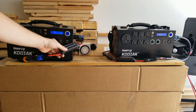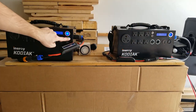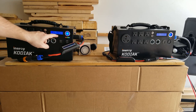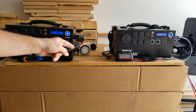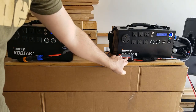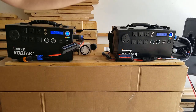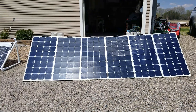You've probably noticed these little adapters connected to my Kodiaks. These are custom-made panel watt meters. The screens on the Kodiak itself only display how much energy is being output — they don't show how much is being produced. These custom watt meters let me see live exactly how much wattage and amperage I'm making from my solar panels. Right now I'm at 30 amps, about 400 watts — so at this rate I can charge from 70% in about an hour.